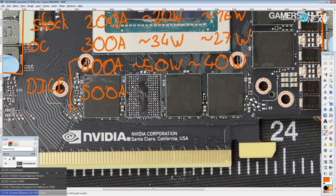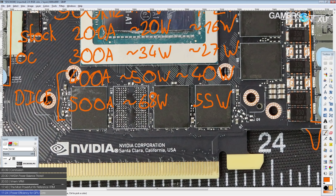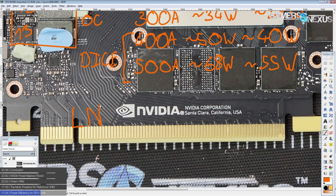For 500 amps, which would be around where dry ice overclocking tops out, you'd be looking at about 68 watts at 1.8 volts and 55 watts at 1.2 volts. For LN2 overclocking, current estimates are guesswork based on how 1080 Ti's behave scaled to the larger die. I'm estimating off the 1080 Ti because TSMC's 12 nanometer process doesn't make much difference compared to 16 nanometer — same density, slightly more efficient, similar leakage.